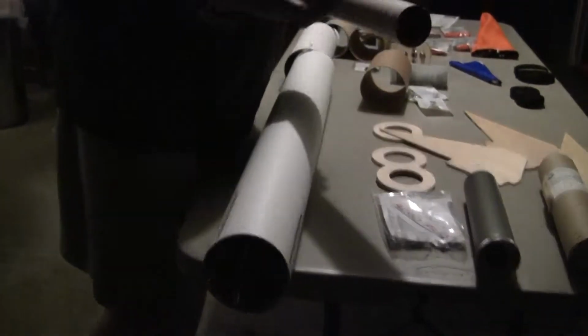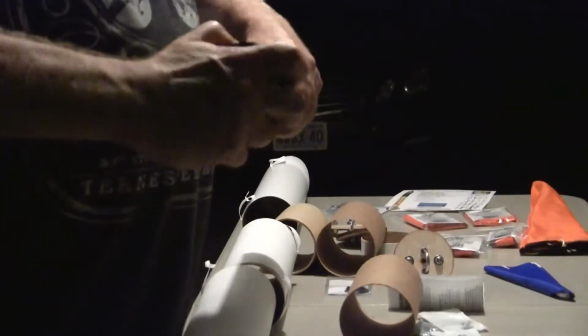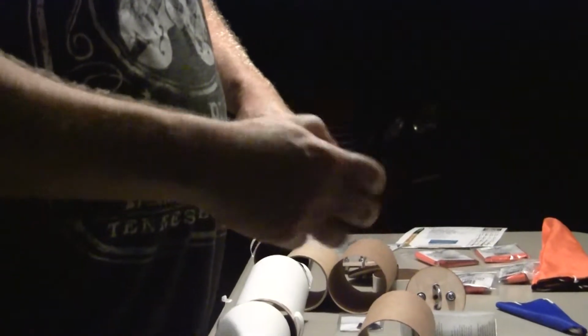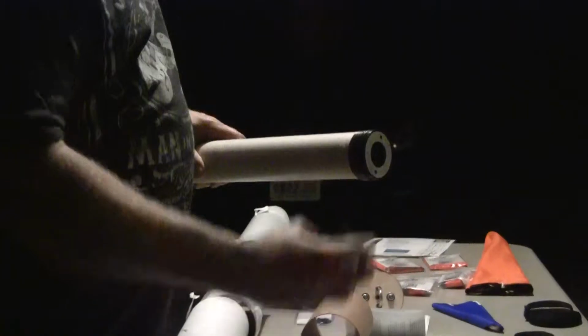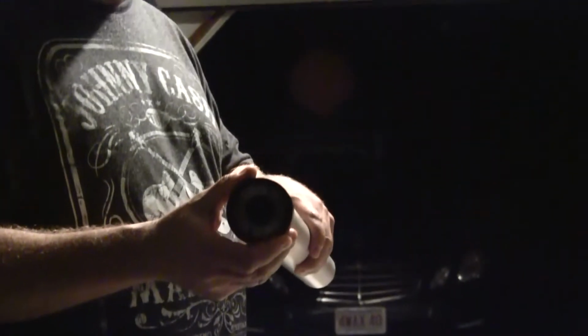And then at the bottom, I purchased an aero pack. We've used these on other rockets. Basically this is an engine retention. It's glued on the end. Once it's on, this screws off like this. This is the load. This is a 2-grain load that goes in. You screw it on, and that's your nozzle for your engine. So technically it would be down here.